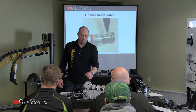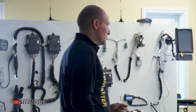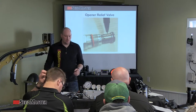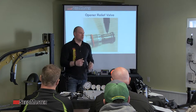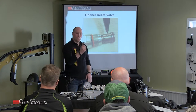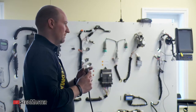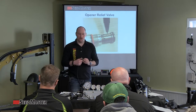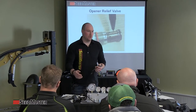With the openers up, we turn on the opener pressure switch. On the cruiser, the foot pedal switch turns on the opener pressure, which powers up the wiring. All of our solenoids have DIN blocks with red LED lights, so you can visually see that there's power on the solenoid — you can actually see that from the tractor cab. Once it lights up, you know you have power going to that solenoid.